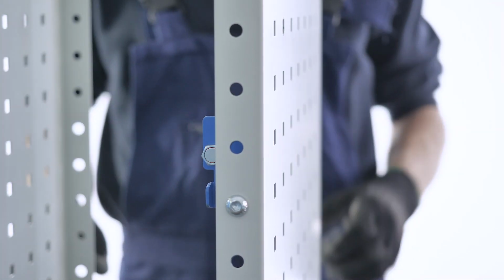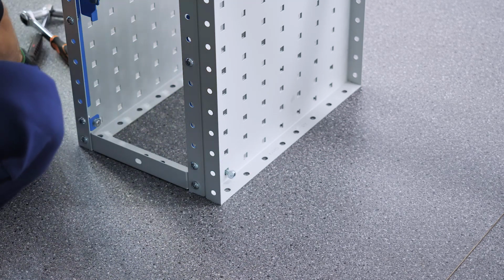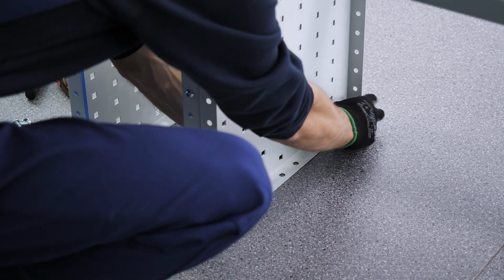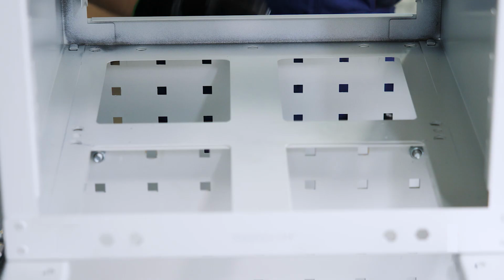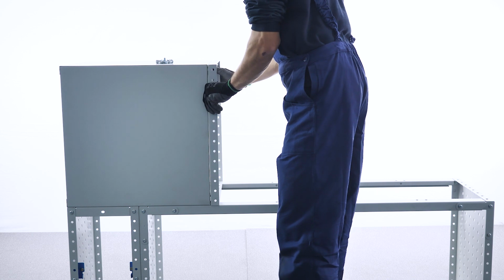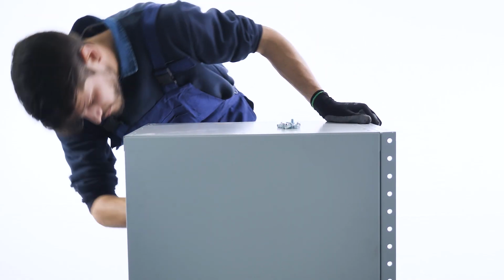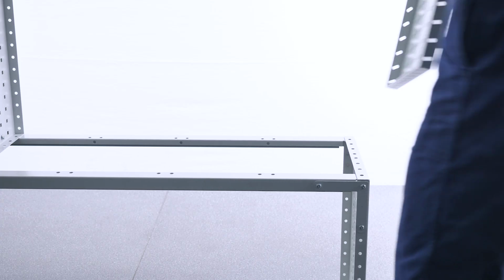The bin compartment can now be fixed to the side panel of the main racking structure, using screws as always. This project also features a cabinet of sideways opening drawers to be installed over the bin, opening towards the bin's outer side panel. This cabinet is fixed in place with 4 screws at the bottom. Now, using 4 screws, fix a side panel inwards from the drawer cabinet. Fix a second side panel at the other end of the racking structure.